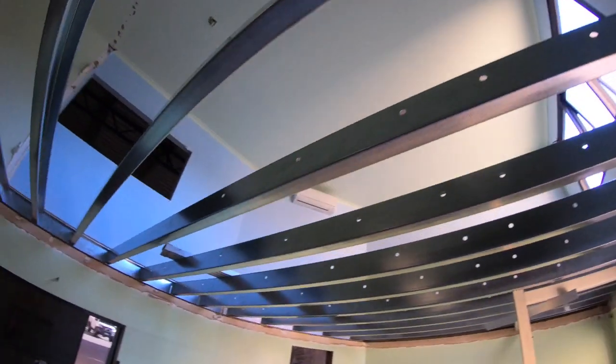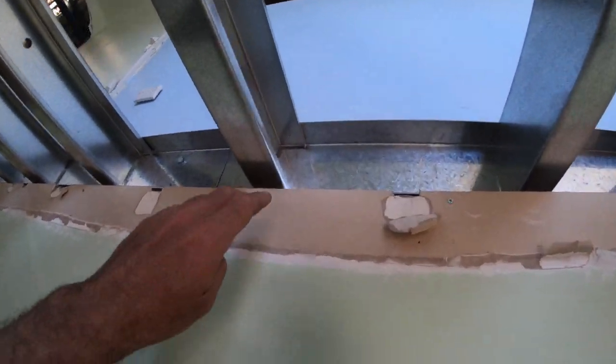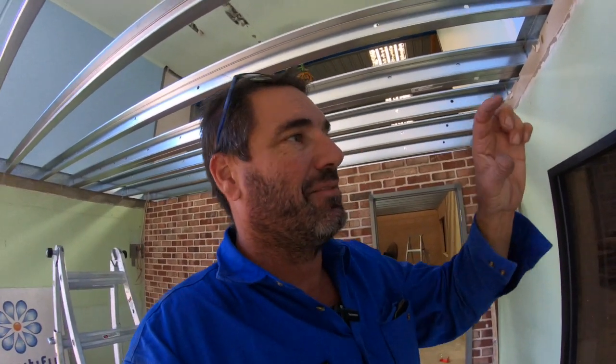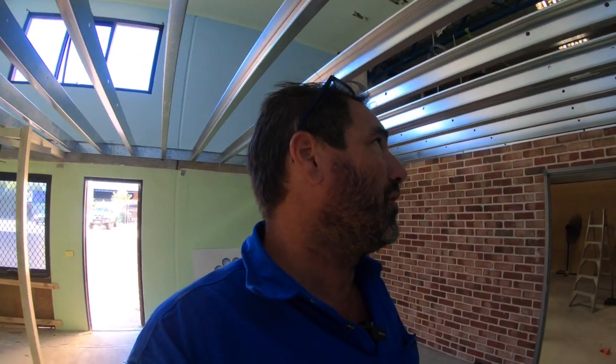But with the other side I've got the wall in the way, so I've got to try and get screws in here. I've got a right angle drill bit that goes on my tech drill, but it's really hard to go through both of them. I need to find a small drill bit to pilot hole first and then pop it through, but anyway it's all secure — not going to go anywhere now.